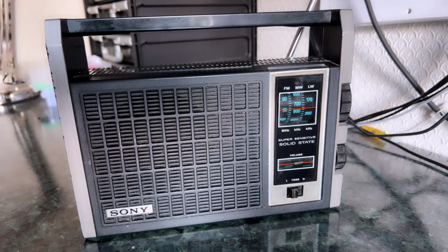Well, there we are, it's all working again. With a lot of these things, you sort of see the potential for getting like 20 or 30 minutes of video out of them, and I thought we might get a bit more for this because clearly the switch was the problem with medium wave and long wave being intermittent, but the FM was giving nothing, so I thought we'd be into looking at the circuit diagram and seeing which of the transistors have failed, or whether the oscillator was running or things like that.